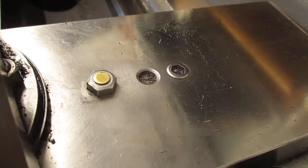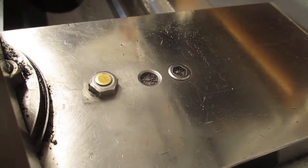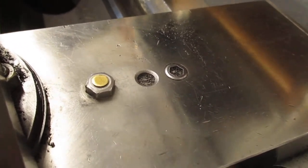So anyway, it's very nice to get lubrication to that cross-feed screw. The screw and nut together probably cost a couple thousand dollars — you want to keep that oiled.